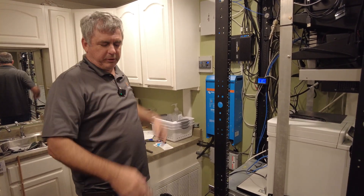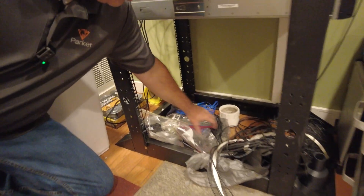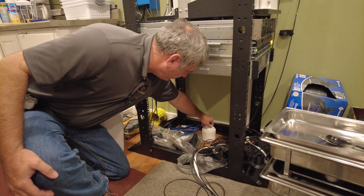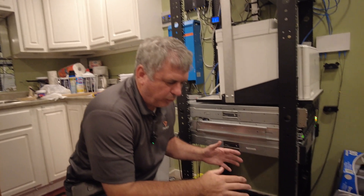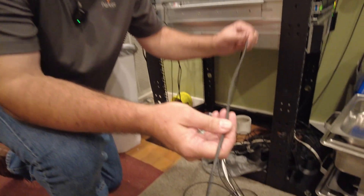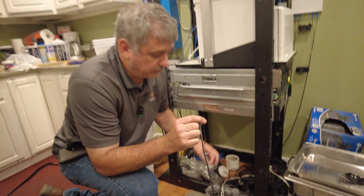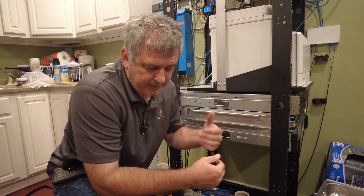By making those reels with 500 feet deployed, we could use this even on hurricane deployments — we run cable between three trailers to push internet, Wi-Fi, and cameras around and bring them back to a central point. The problem is you couldn't get that mini wall through a three-inch hole — some trailers only have a two-inch feedthrough. That's why we want something deployable that you can drop the cable out when traveling. That's the problem we're solving: getting 12-fiber density from place to place. The drop fiber is a lot more durable — someone steps on a rock it'll shear the ribbon fiber, but you could drive a truck over the drop fiber.